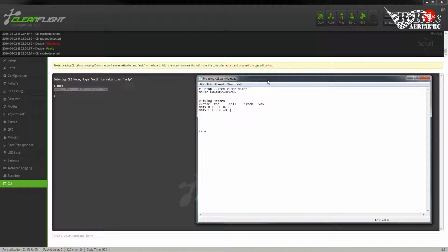and that'll cause the plane to pull towards the right. If I was to provide negative, then it will produce negative times 30%, so it'll be negative 30% now on the left motor, and positive, because two wrongs make a right here, on the right motor. Oops, that would be my transmitter. Let's shut that down. Okay. And that's how you basically do differential thrust. It's not that hard. Everything's set up here.